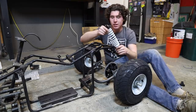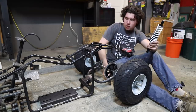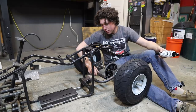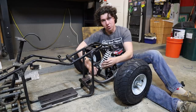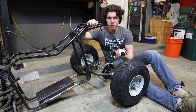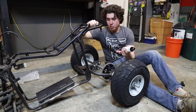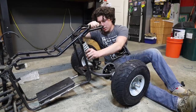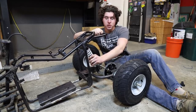Here's our Go Power Sports shock — it's very pretty, all white and black. I'm going to incorporate a big contrast with white and black in the color scheme. I cut out a little bar that's going to act as both a shock mount and a support, going right in between the swing arm. I'll mount the bottom of the shock to it with two little eyelets, then utilize the factory upper shock mount — though I'll probably add one extra bar to it. This is the first rendition; if it's too springy or too low we'll adjust. The goal is to droop about two or three inches off the ground.